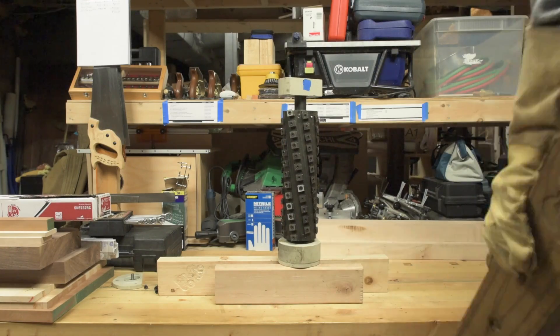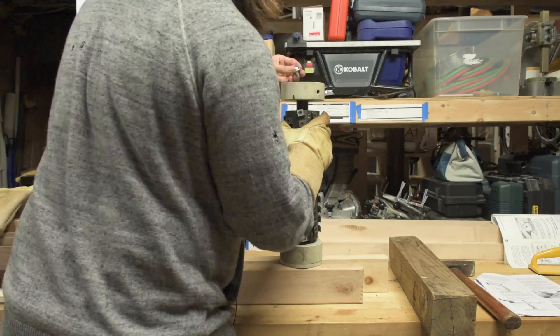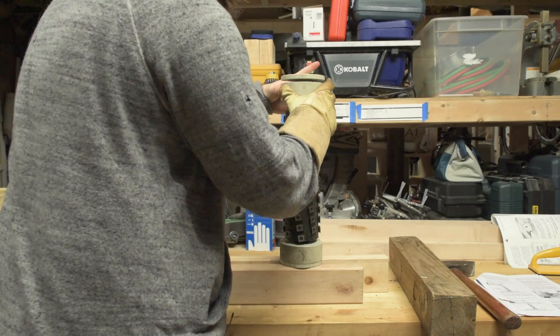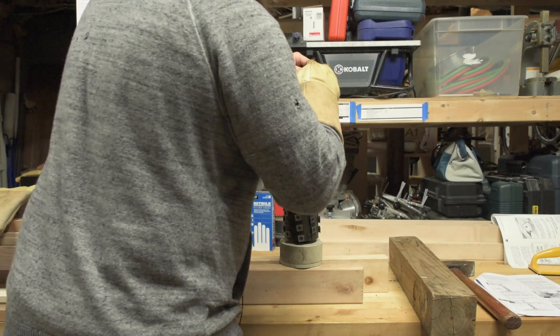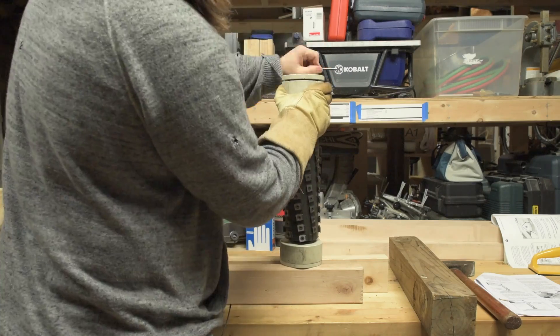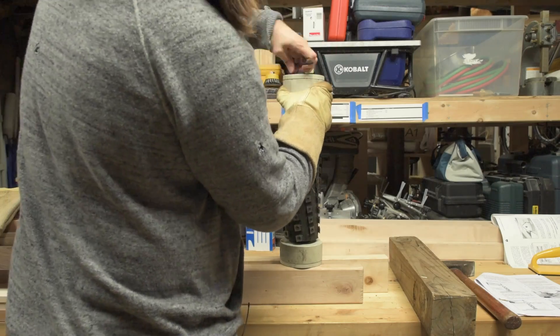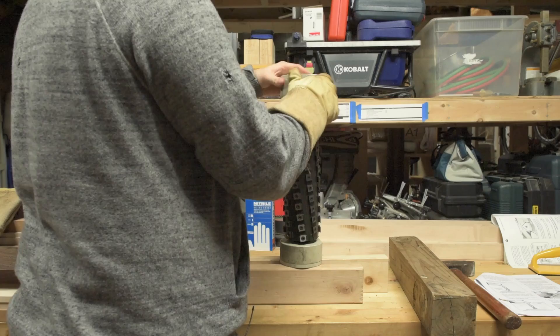This one's going on much easier. Use a hammer and a scrap piece of wood to seat the front bearing block onto the cutterhead shaft. Tap the front bearing block until it meets resistance. Secure the front bearing block with the hex bolt and flat washer removed in step 25 on page 5, then reinstall the cap with the three cap screws. I assume that this part is designed to actually draw the piece up into the body, which is good — that'll seat the bearings just so. I don't hate that bearing cap; it seems like kind of a good design, kind of self-setting.